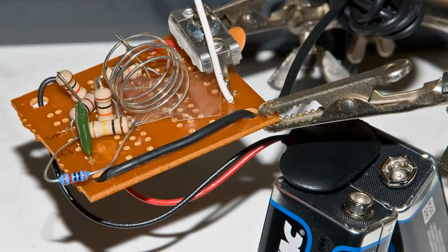Here's a closer look at the very quick modifications I did to this little FM transmitter. That 10k resistor across the 100k resistor — I would actually remove the 100k and just put in a 10k. The total ohms the way it is in this picture is a little over 9k — about 9k and 90 ohms.